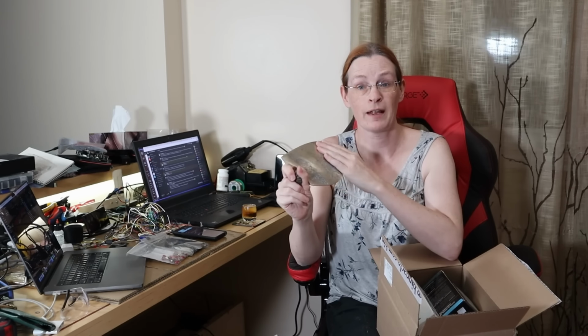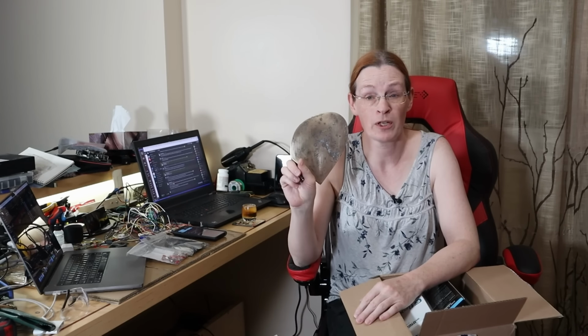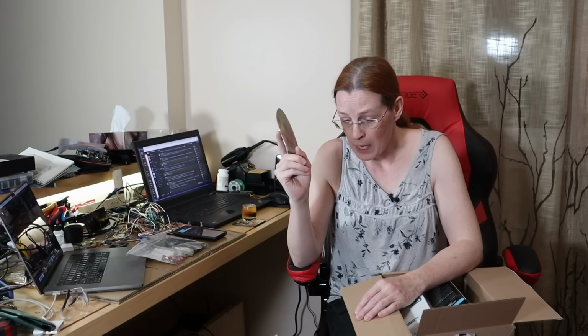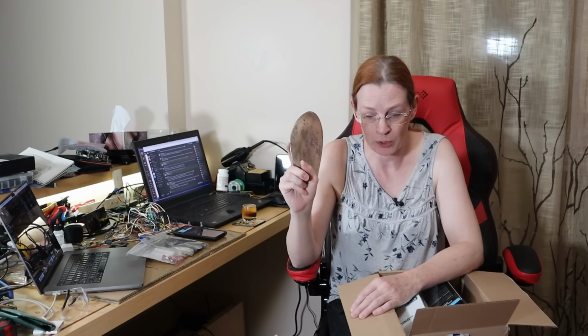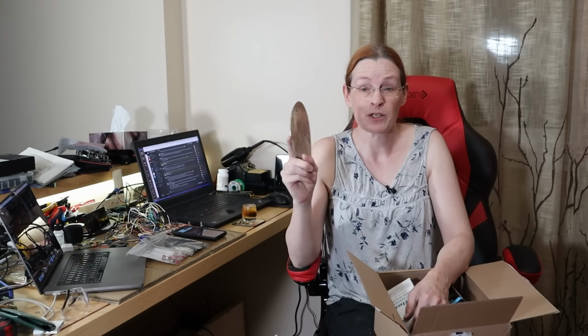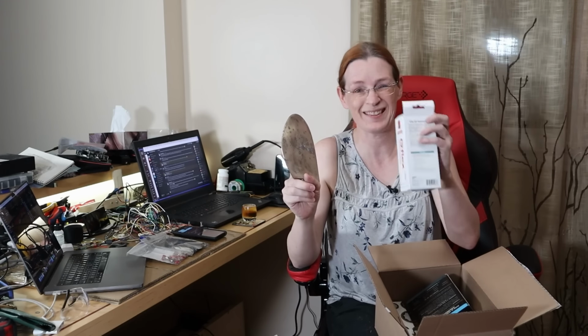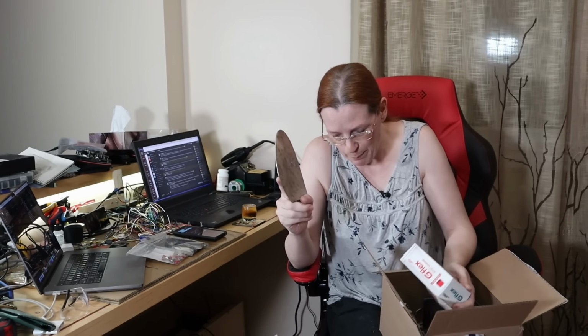One of the other problems about potentially grinding this back to get down to a smooth surface is throwing balance off. Considering this pitting was already on the boat when I brought it home and I motored a lot on the way home, I never noticed any vibration. And with the electric motor, I'll never be going above 1000 RPM. I think this is rated for a maximum of 1500 RPM, but I'm going to try to aim for like 1000 RPM. So it's not like it's going to be spinning at a super high speed, but leaving as much bronze as possible will help keep it in balance. And this is obviously not the same weight, but I think the pitting is relatively equal, all things considered. It's going to be close enough.